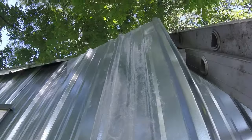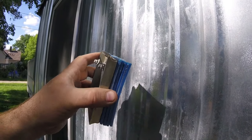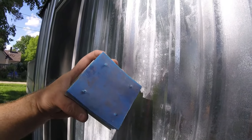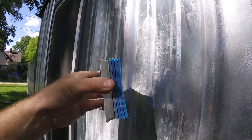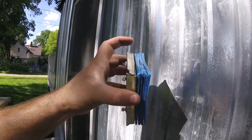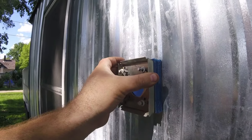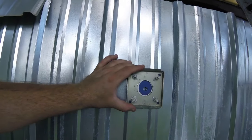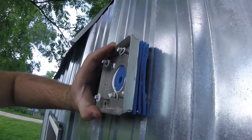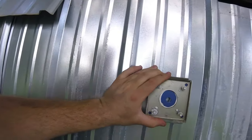Just wanted to detail that out since it's a little unique situation. For the spacers on the mounting plate, I decided to use plastic cut from my rain barrel — I cut it into squares to the spacing I needed. I wanted it to be waterproof and rigid, so I decided to do it that way. I'll put some caulking on the top and back, and I also did a little rubber seal on the end. I just wanted to make sure this was sealed — I didn't want any water going through there.